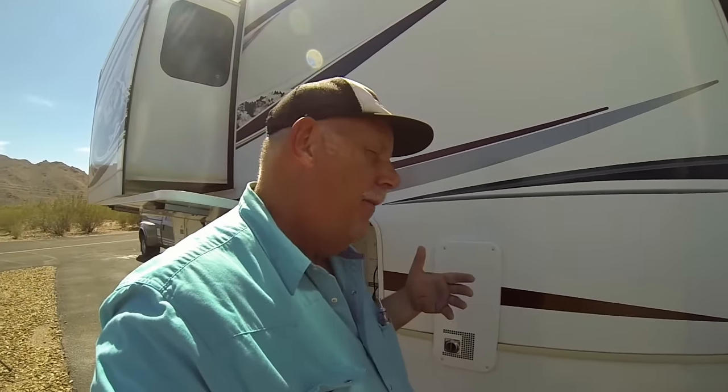This is a three-year-old RV and things can get kicked in there. We're going to send a snake type of thing up into the tubes at high pressure and really clean the tanks out. Before we do that, I'm going to flush the tanks over and over again today just to get as much stuff out as possible - that's a courtesy to him and ensures we get the most out of the process. It'll be interesting to see if we succeed in fixing that valve without actually replacing it.